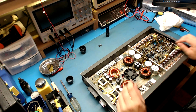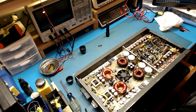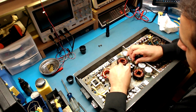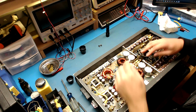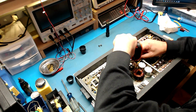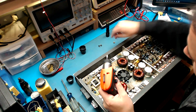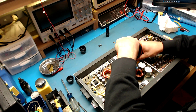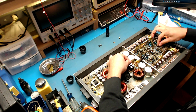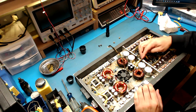Like I said, this has a split design. The power supply is split here, a switching supply, and your amplifier is on this side. And if you actually take this connector out, just get something in there, and it's got a little clip on it. You remove that. You take these 2 screws out. Remove these 2 screws. And take this cable that goes all the way across over the amp board. It plugs in right here. Remove that. Now you have isolated your power supply from your amp.